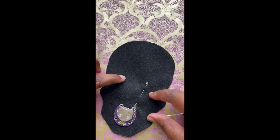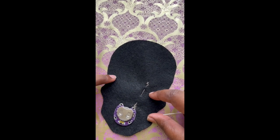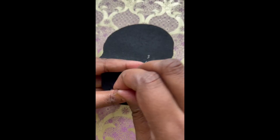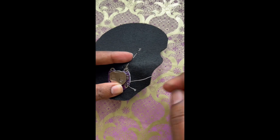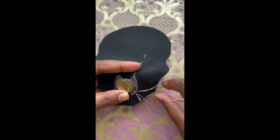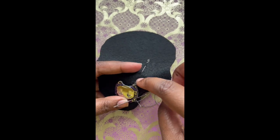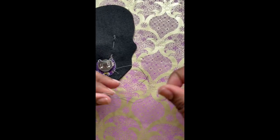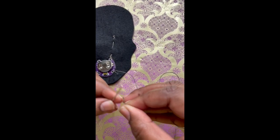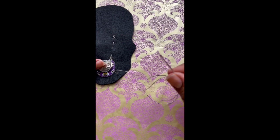Again, we're going to do the negative terminal on the inside towards the nose and the positive terminal of the LED to the outside, towards the outside of the face. You have to be careful of the thread ends because you don't want to short circuit your circuit by connecting the wires to each other. Don't make the ends very long — a short circuit can basically completely run down your battery in no time.